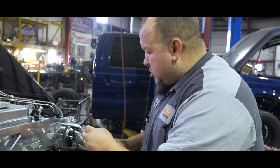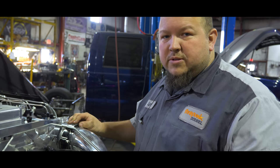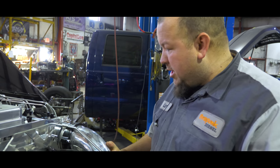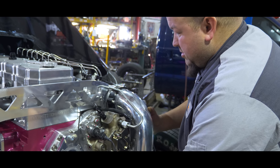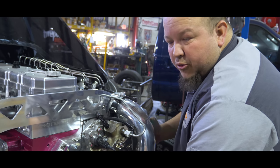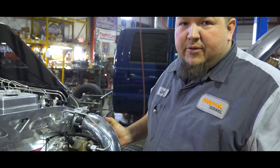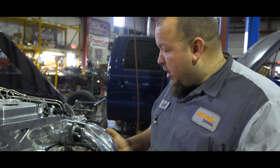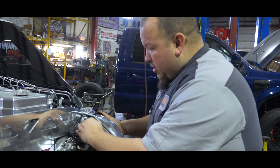Let me show you how much movement this clamp has. Currently I don't have any o-rings in it, so it moves a little more freely than it does with o-rings, but that doesn't really change the range of motion. You can see this pipe can move quite a bit — there's about a quarter inch of in-and-out movement and 12 degrees of up-and-down movement. If you fab the pipe where it's already in a bind, it does have a range of motion limit, so keep things fairly squared up when fabricating.